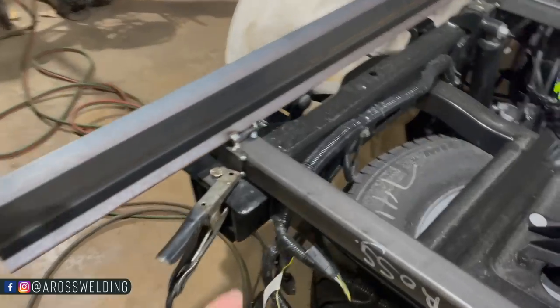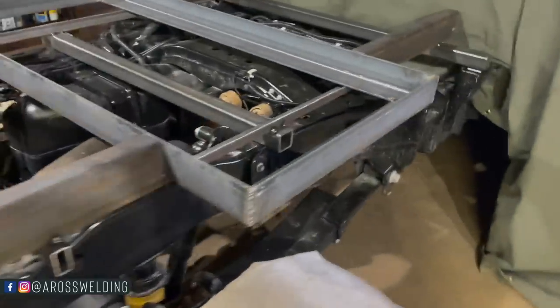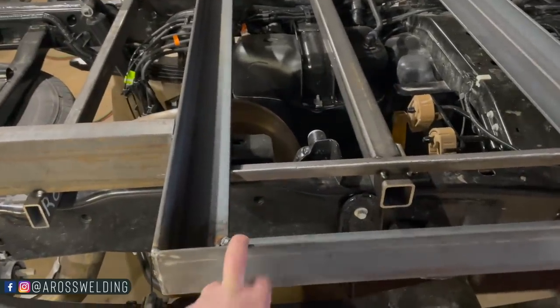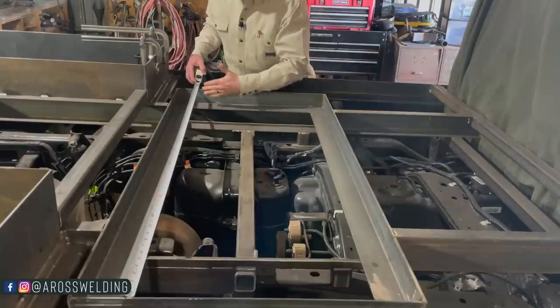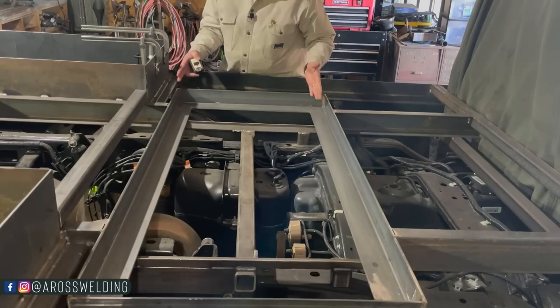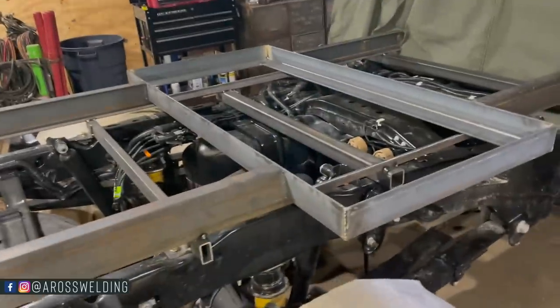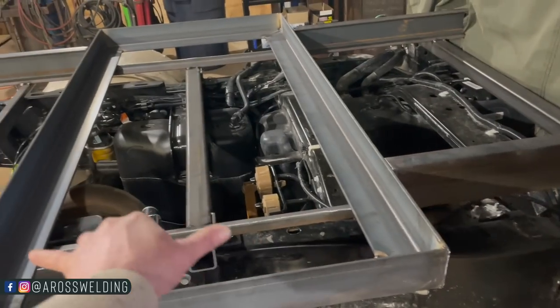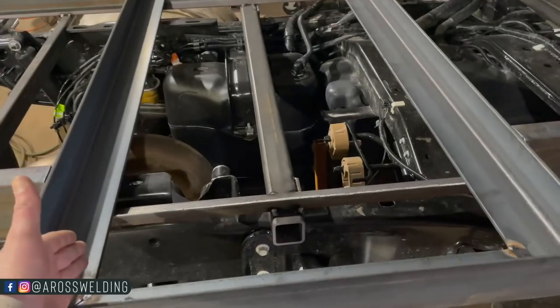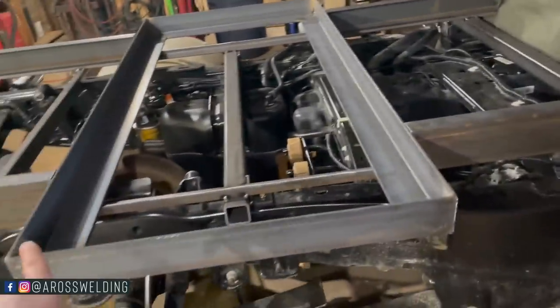Update. We've got 1/2-inch spacers here in the back. Made a universal drop out of 3x3 by 1/4-inch angle, 27 inside by 57 inside. Correction, we've actually got 58 inches from inside to inside, and then we've got 27 inside dimension this way. Should hold an SA200 frame as well as like a Miller 400, should hold both of those. Obviously, the SA200 or a machine like mine would have quite a bit of space, but it's universal. Notched out the 4-inch channel, come down.